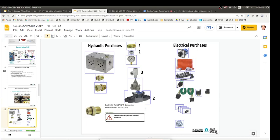You've got things like bypass valves. Before you feed fluid into the system, you want a safety valve, which, if it overpressures, you set that knob on top and it will bypass fluid back to the power cube, to the return. You've got a little pressure gauge on it to know where you're at, and you can see the pressure every time you're pressing. It's kind of low, maybe a few hundred psi. Then when you hit the pressure, it goes to like 2,300. You know it's working.